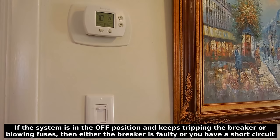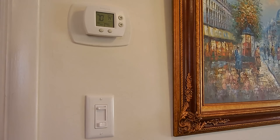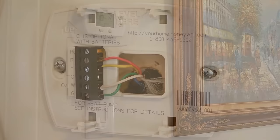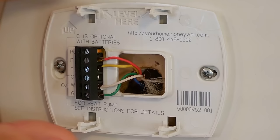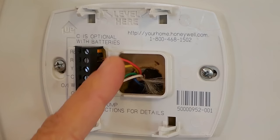If the circuit breaker is in the on position and there are no blown fuses but the fan still does not come on and there's no heat, the next thing you want to do is unscrew the thermostat from the wall so we can perform some tests on the wiring. Usually there's a tiny screw, or you can squeeze the plastic and pop it off. This thermostat is held on by plastic tips — grab it on the top and bottom and pull straight out.